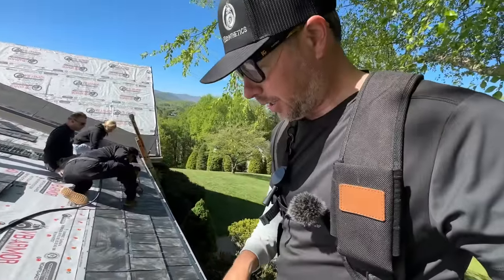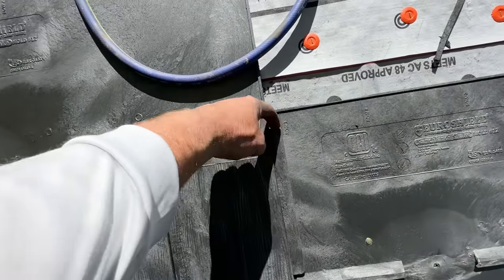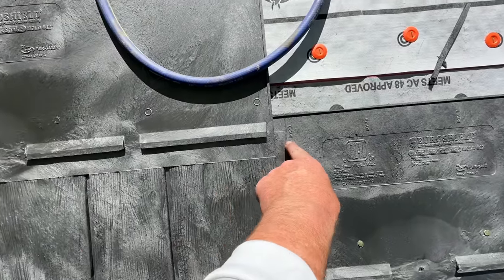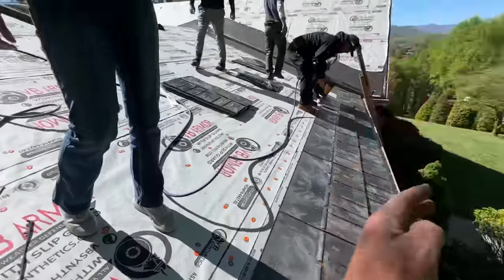As far as our stagger goes, it's pretty easy — they're indicated on the top of each panel where you're going to cut the little flange. So we're on the one-two-third row; I've got the little flange here on row three cut, quarter-inch space, on down the line.